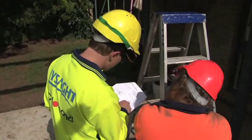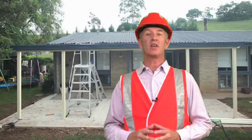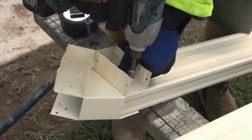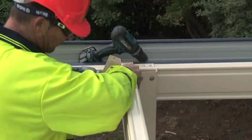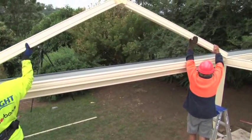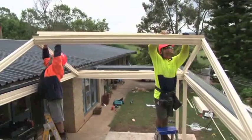It's now time to add the pitched roof structure. First check your CC builder plan — it will give you the dimensions to cut your rafters. Add gable end connectors to the top of the beam and bolt and screw to the end rail. Install the rafters on the gable end, first starting at the house end. Cut the rafter to length square. Connect the crown delta connector to those trimmed rafters. Position the rafters into the gable connectors and screw into position. Calculate the distance between the trusses and mark out the location on the side rails. Put the connectors on the side rails. Cut your top purlins to length, which is the measured distance between the inside of the trusses. Drop them into position and fix together.